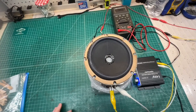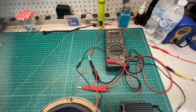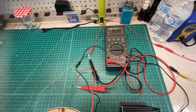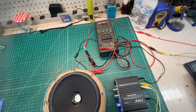I've got the loudspeaker hooked up, going directly to the voice coil. The DC current across the field coil is right at 40 milliamps — that's where the radio was playing originally, so I think that's about correct.